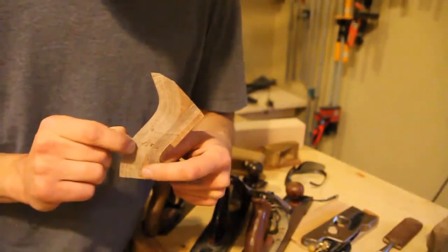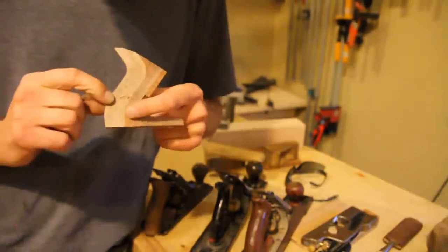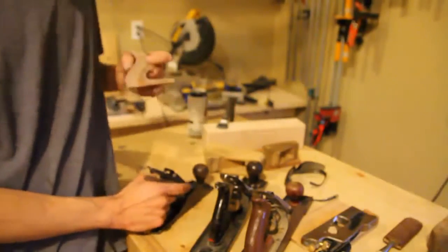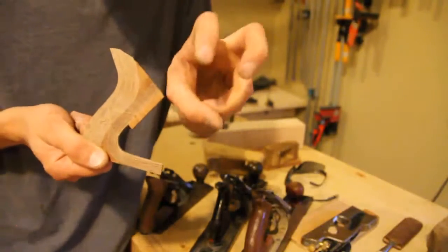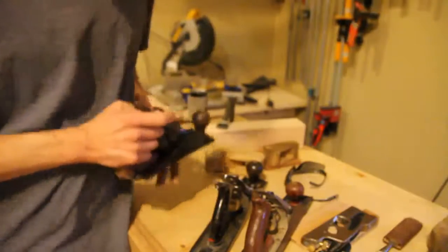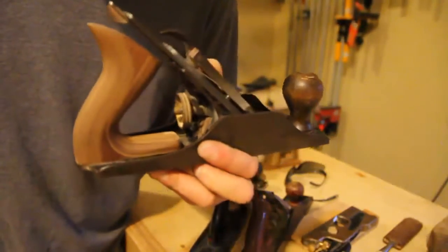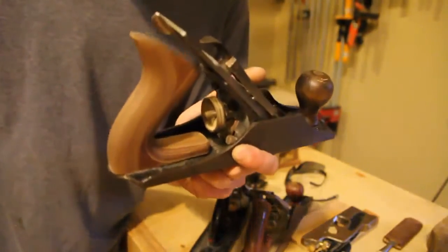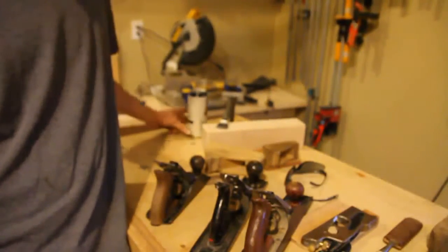And then I added these little solid mahogany blocks in the corner, and then glued on the veneer on the back. And then it works well because now you've got continuous grain running through the curve of the weak spot. And so that's what it looks like all shaped up with a coat of, I don't know, linseed oil, probably, knowing me. Not linseed oil, sorry, Danish oil. I'm a big fan of the Danish oil. And yeah, that's that. Cheers.